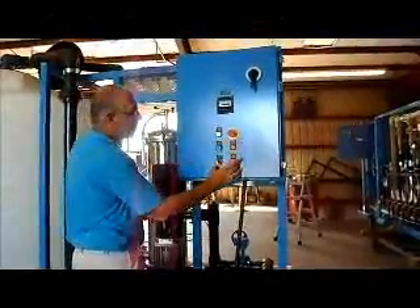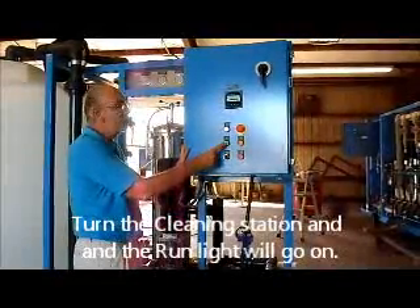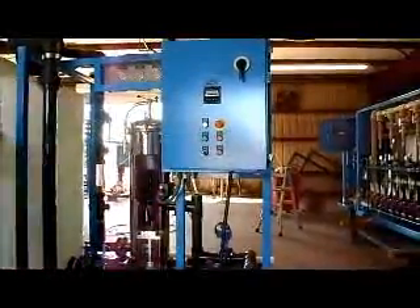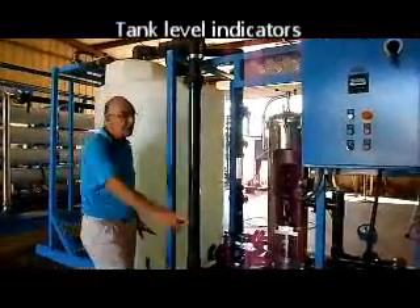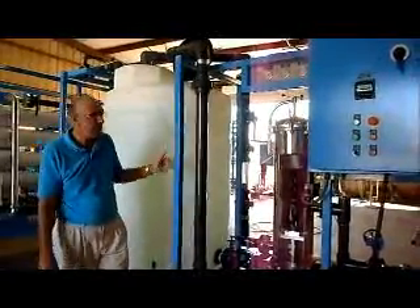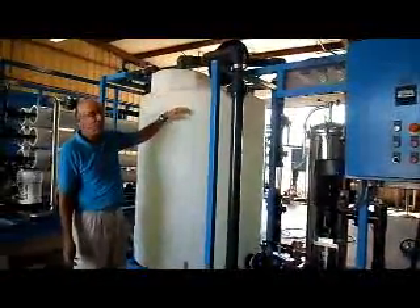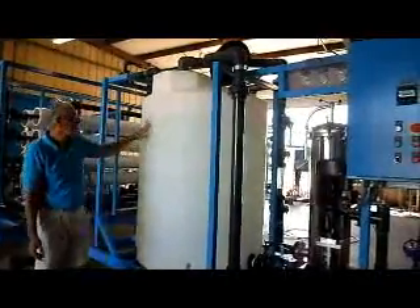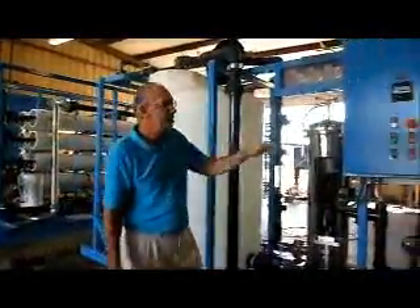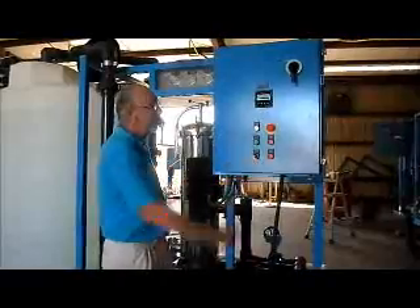The controls on the front panel are very simple. Basically an on/off switch: turn the pump on, and the green light comes on when the pump runs. These two lights are level switch indicators. When the tank level is too low, the bottom light comes on indicating low level and the pump will not be able to run — it locks out the pump so it cannot run dry. When the high level light is on, the tank is full enough and you don't need to add more water. It's not an alarm — it won't stop anything. It just tells you how full to make the tank. To run the system, just turn the pump on. It's that simple.